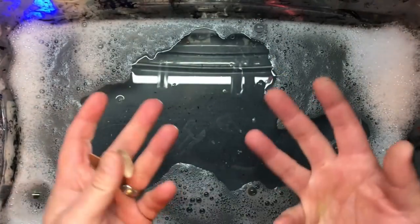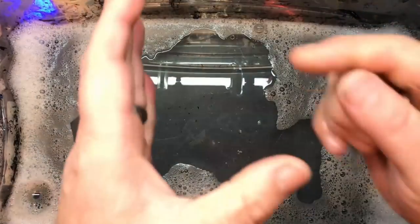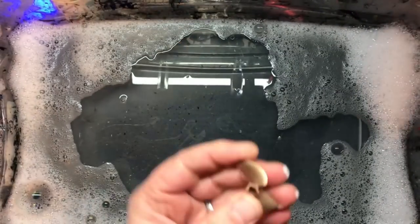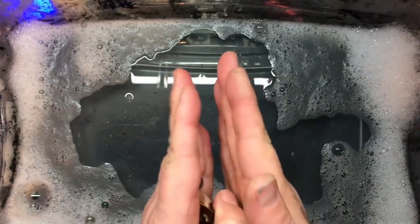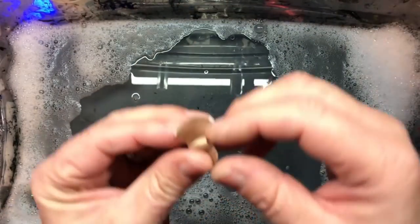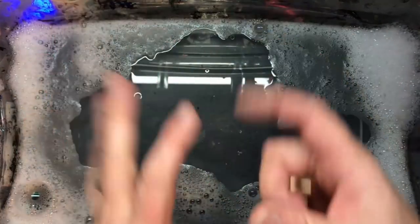When you're not cutting clean, it's just like a quad. Not only will you get vibration from being out of balance - and that's what we always worry about with quads and planes - when you're out of balance you get excessive vibration, things rattle apart, and that's bad for a boat too. But you want to be sharp because you are cutting through a mass. If you don't cut sharp, you get friction, and when you get friction you get what's called cavitation. Cavitation is the boiling effect of water, believe it or not. You can also aerate - sucking air down into the prop blades - which causes more cavitation. But actual cavitation will happen even on a submarine. That's why submarine propellers look so funky - they might have like 20 blades, all crazy shaped, and that is to limit the spin in the water to reduce cavitation.